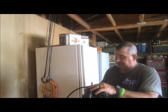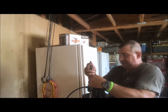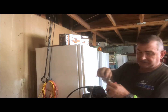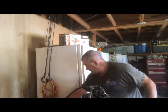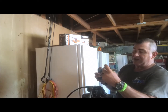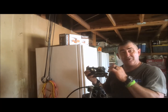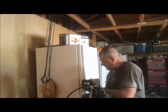And then this is the Brine Piston, which sometimes is a pain to get out. It's just a little spring, and so when it goes through the brine cycle, there's a little setting, and so this presses on the brine piston to let so much water into the brine tank. So like this says it's going to 9 pounds of salt, so it's going to allow that much water in there to dissolve 9 pounds of salt. By pressing this on, water will go down this tube into the brine tank.